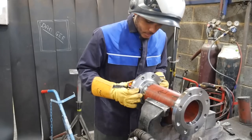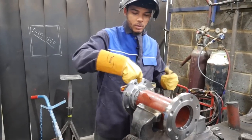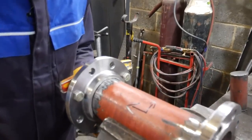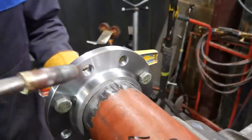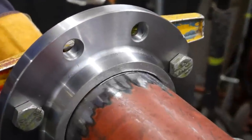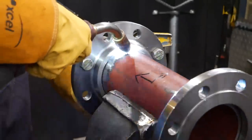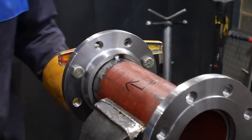Lining it up to the chalk mark on the back. If you look closer up here you can see the gap that you make by sliding the flange at an angle - if you were to leave it flat you'd have no gap. Sliding it at an angle puts a gap there. Watch your eyes - second tack on, now I can pull the flange up and it locks that gap in.